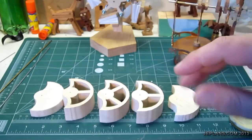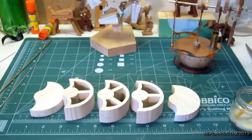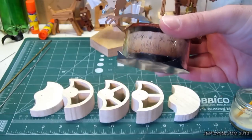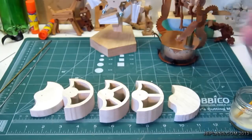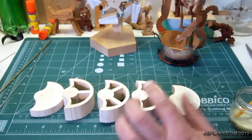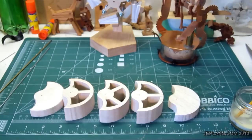The reason for this is as the area inside the engine gets larger and the displacer gets larger, a lot of the power would be absorbed by that air that has give inside the displacer. So I'm going to try and make it so that the displacer is somewhat less permeable to air, giving the engine perhaps a bit more power.